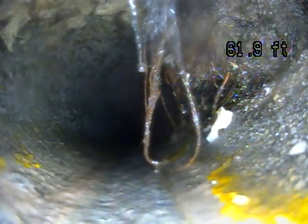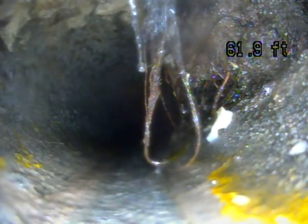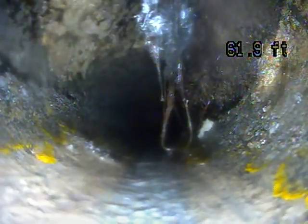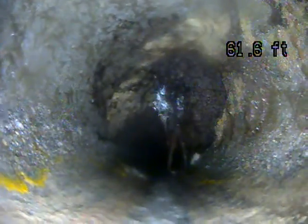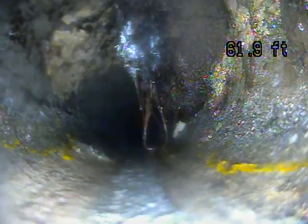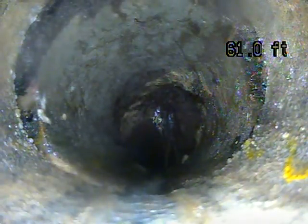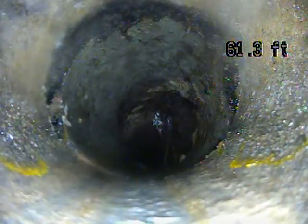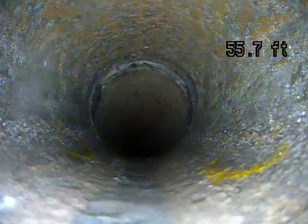That's just a maintenance item. Once you have roots, you'll always have roots. You just need to maintain it so they don't get big and catch on things, which can cause a backup. Some houses can go a couple years, some only a few months or six months or so. When this is cleaned out, I'd recommend that it be hydro-jetted, and that'll blast out that entire piece of root. Then they can look at it with a camera and see if there's a section of this pipe missing. If there's a section missing, you'll need a spot repair, which can be costly. A few roots are coming in around that joint. The biggest concern so far is not necessarily the fact that you have a root, but where it's coming in.